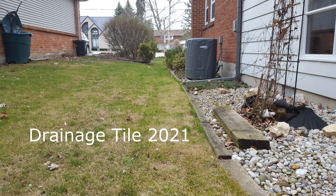I decided to install a four-inch diameter drain tile right where you see the 4x4s used as the garden edge. I was going to drain to the front yard, but I only have about a six-inch decrease in height, which isn't a lot to go nearly 100 feet. I checked with the town about connecting to the storm sewer, but the connection is four and a half feet below the sidewalk. I'd have to break the town sidewalk, get a permit for several hundred dollars, and pay somebody to connect. I had a couple contractors look at it — nobody wanted to do anything for less than $8,000, so I had to find a better way.